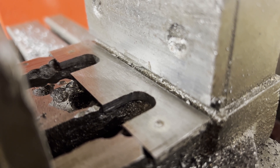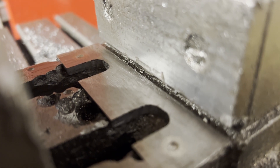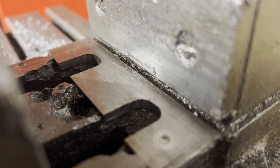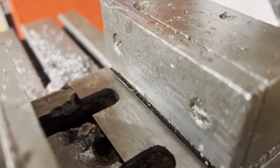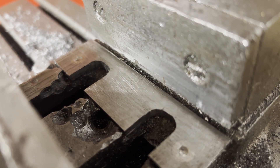And we are done. The eagle-eyed may notice those slots for the slides are much deeper - yes, they are. There's the cutter to prove it. I went by the bottom depth in there and they actually need to go a lot further, so a bit of careful measuring and we are there. This means it's all nice and true. I can't feel the difference between the two beds or the bolts holding it down. That is true to the bed, which is true to the head.